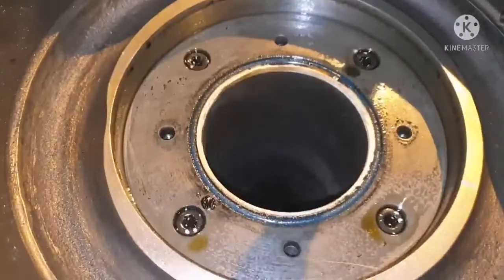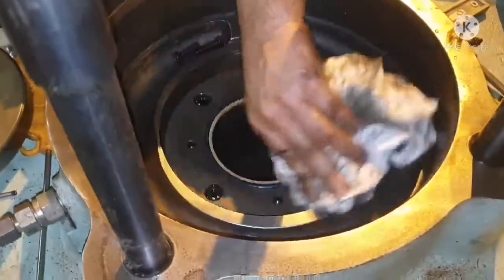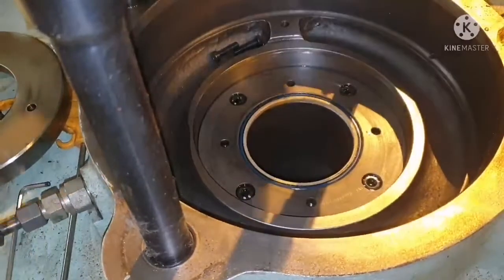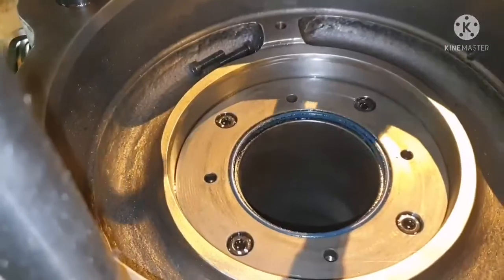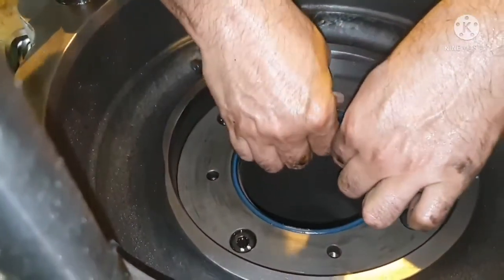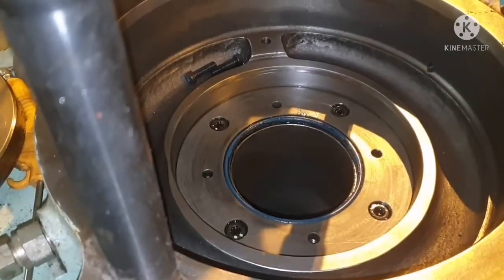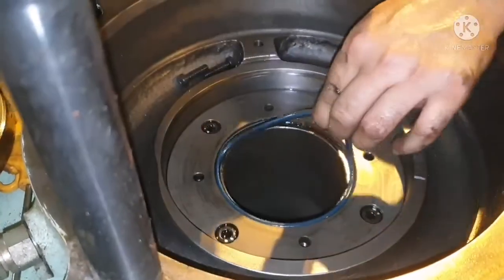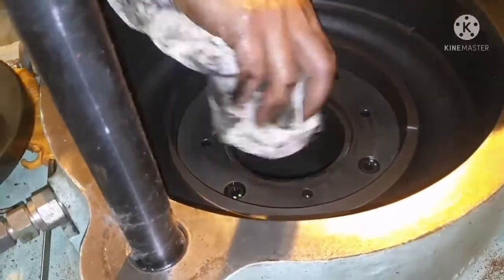You can see the seal ring. Wipe out any oil or carbon deposits over the area and then you can remove the seal ring. It's a Teflon ring, and the other one is your O-ring — a special O-ring which can handle high temperatures. So this seal ring contains two rings: one Teflon and one high-temperature O-ring. Ensure you are using the proper spares.